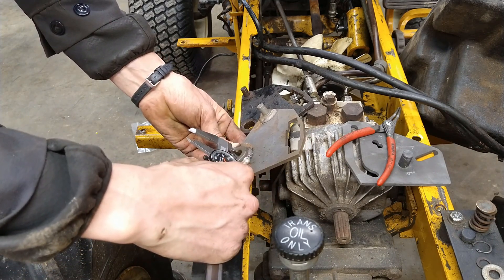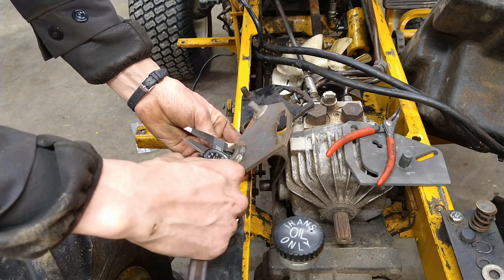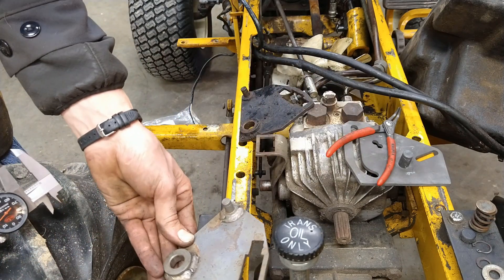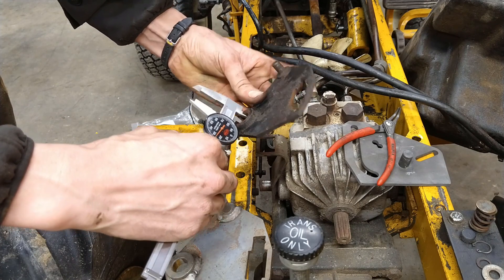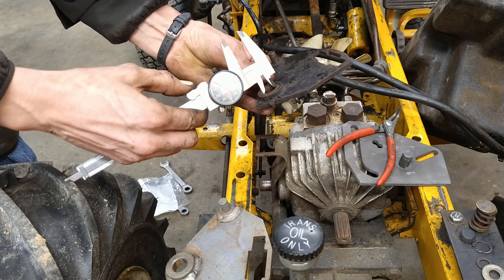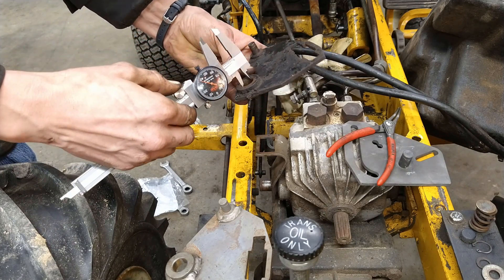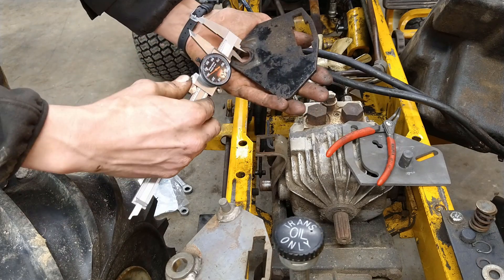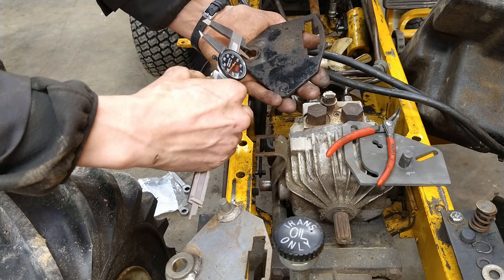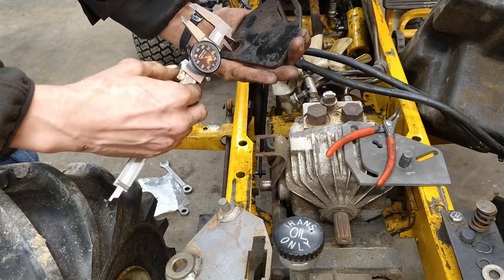Here's our new one — looks about right. Let's go get a caliper real quick and measure the bore on those and see how worn it actually is. We're getting about 625 — almost dead on a 5-8ths hole there. 625 is where the wear is. On that side it's 640. This side here is about 625, then 635 on the other.